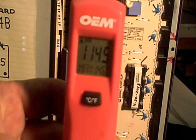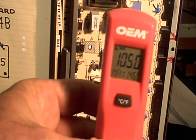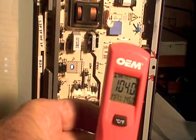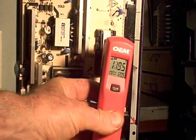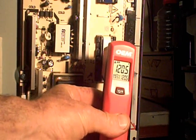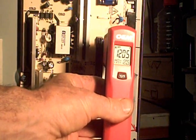If you don't have a temperature probe I highly recommend you get one, although one that fits right on a meter might be better in some cases. Basically I can just point it right at the transformer and see the temperature it's operating at. I noticed that the new transformer was running awful hot and I was a little bit nervous about it.